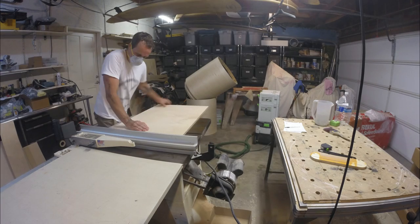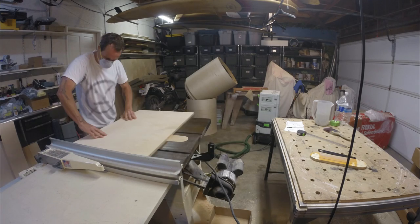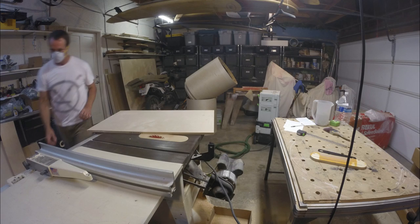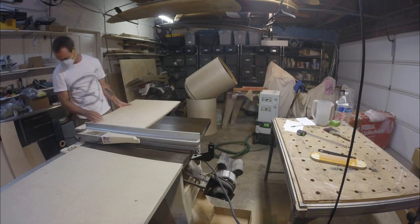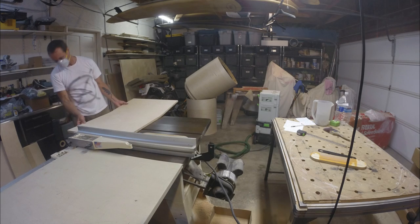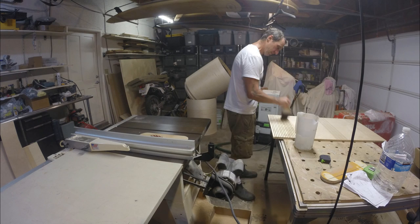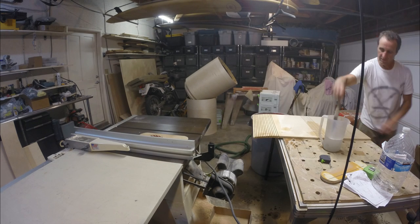What I'm doing here is making something that looks kind of cool. I wanted something that didn't have straight, sharp angles — something more round. So I put two saw blades on the saw about a half an inch apart, making cuts almost all the way through the wood, leaving about a mil and a half — a couple layers of the 17-ply Finland birch wood.